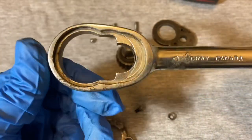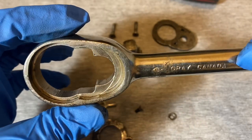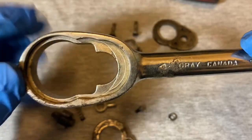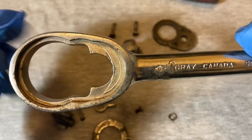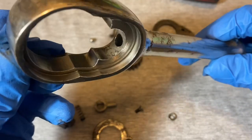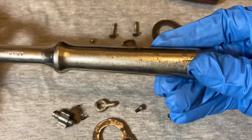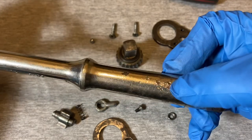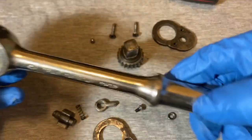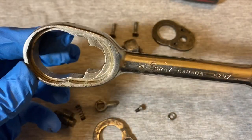And this is what the head looks like without all that stuff - looks pretty decent, looks pretty heavy duty. The broaching seems okay - looks pretty clean, not too bad. Looks like there were some passes here - you can see like three little circles. And the other side - there's a big hole for the spring down there. We can see that this handle has been hit a little bit - that's maybe why it's missing some of the crowns on those teeth. Maybe somebody took a hammer to this trying to break a bolt and took some of those tooth tips off.